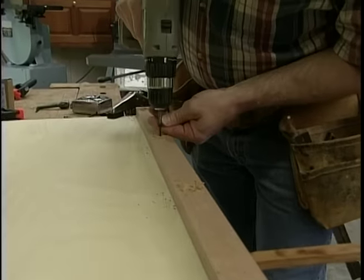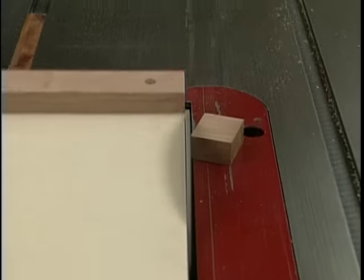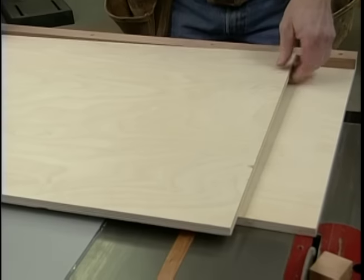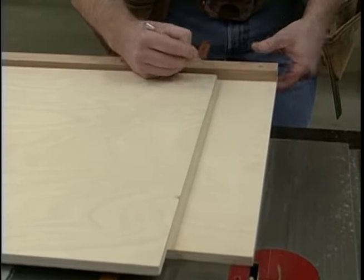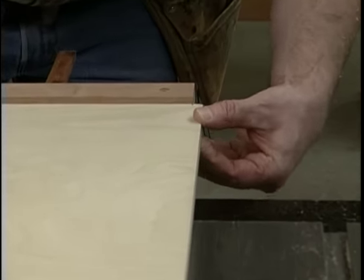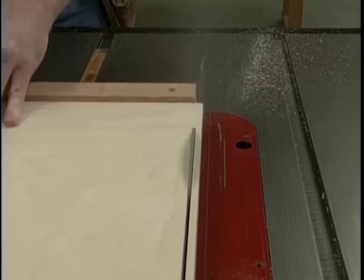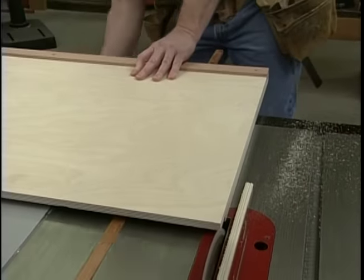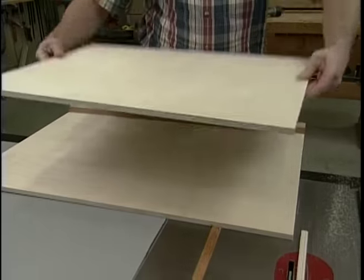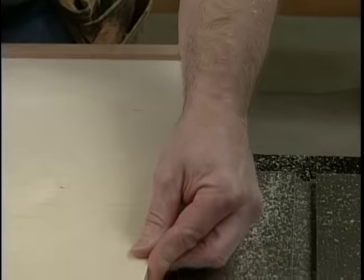Once again I have pre-drilled holes, this time for one-inch screws. Now I can trim off the stop. Let's give it a test run. If I want to cut a panel, what I would do is mark my length along the back edge, and then slide it up against the fence and bring the pencil line right to the end of the stop. That way I know it's right even with the saw blade, and run it through. The true test, if I've got a perfectly square cut, is to take the panel, flip it over, slide the opposite edge up against the stop, and see if it's even with the end of the jig. And it is, so we know it's square.